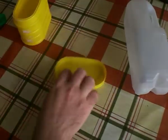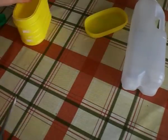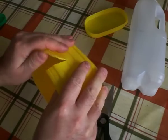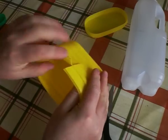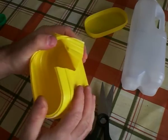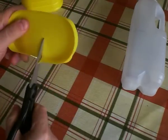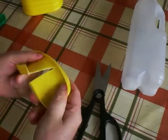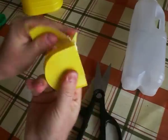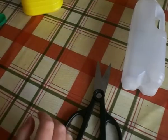If plastic isn't marked, there are ways to tell whether it's polypropylene or HDPE. When you cut HDPE, it cuts fairly cleanly and bends without discolouration. If you do the same thing with polypropylene, it tends to snap and turns white when stressed. Not entirely reliable, but a reasonably reliable way of identifying the plastic.